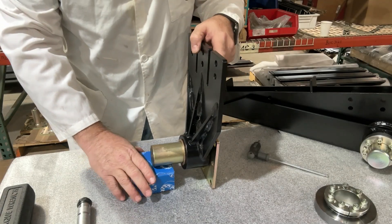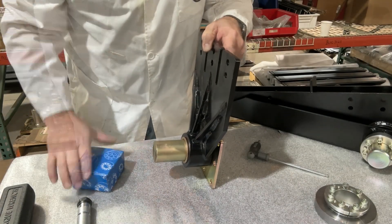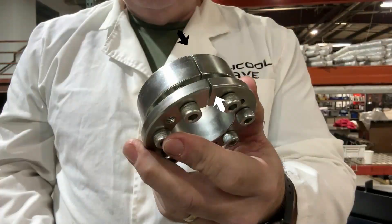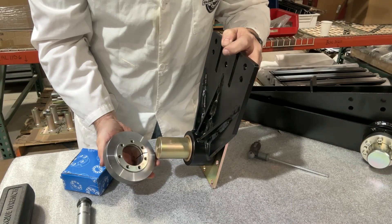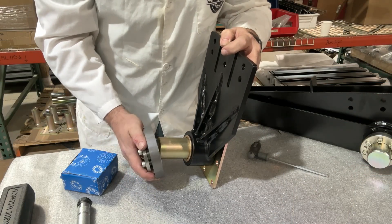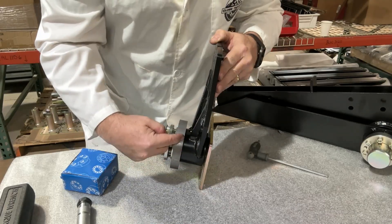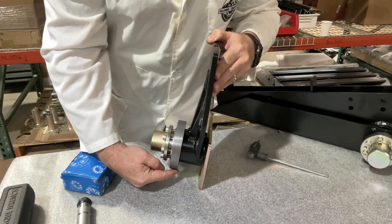Here is a tutorial on how to get these shaft lock collars on. Fit it inside the bore lock ring, and ensure that the lock ring gaps are also aligned. Then slide the whole assembly onto the shaft, getting it as close to that oiled bronze bushing as possible.